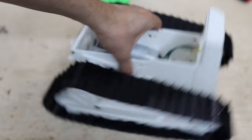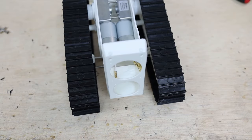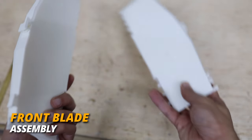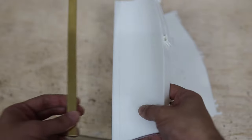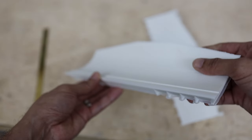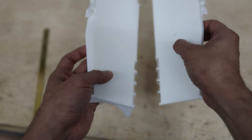The tracks are complete. For the front ripper we have two pieces — the front and the back. For the front part we have two options: one with a channel so we can put a metal sheet here to make it stronger, or we can 3D print the one without that option that is all 3D printed. The procedure here is sanding these two parts, then gluing them together and securing with screws.